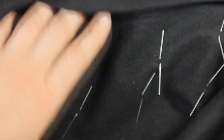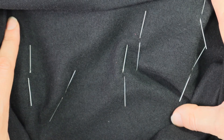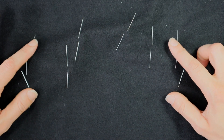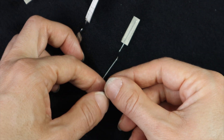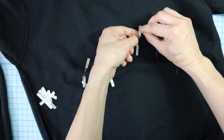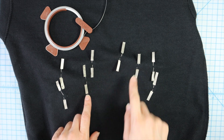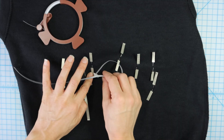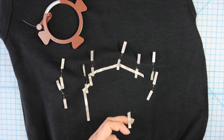If I turn this inside out, the legs are all more or less going in the same direction, which helps when laying out my circuit. I have my four interior LEDs for one circuit and my four exterior LEDs for another. I'll add a little bit of Maker Tape to each of these legs to make them easier to connect — about an inch, placed around and folded over. I'll connect the negative legs together first with some Maker Tape, and use extra pieces to reinforce my connections.